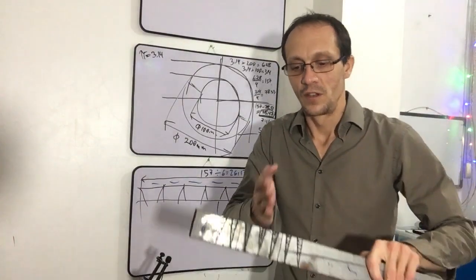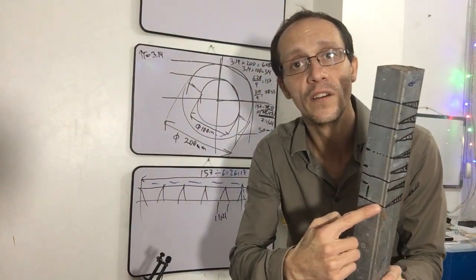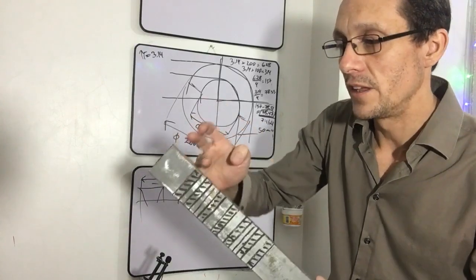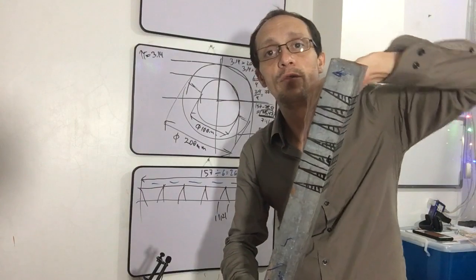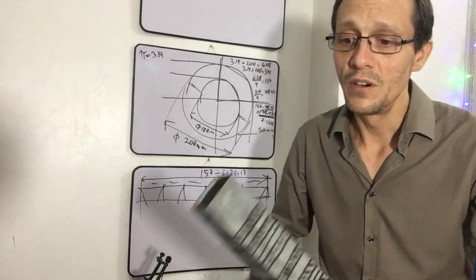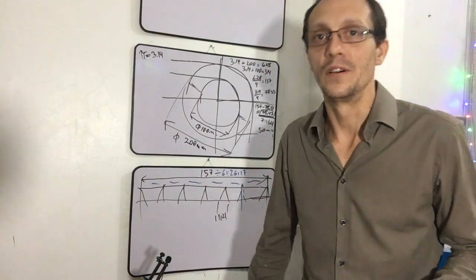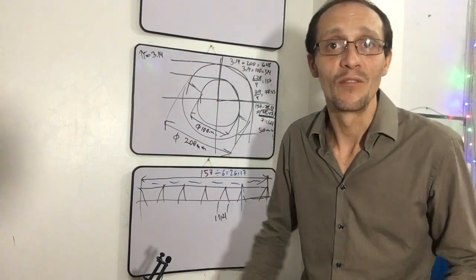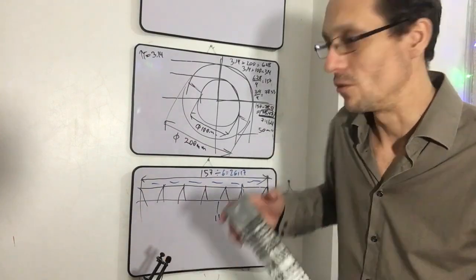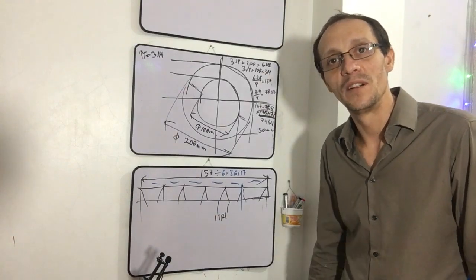Once you're finished with your calculation, you can go and cut away the triangles with your grinder or saw. Here you don't make any cut — only at the marked spots. You make the cuts here, cut out the triangles, and then when you do the bending it will be exactly 90 degrees. After that you do a little bit of welding, then fill it if needed — like body filler — or just do a good weld, then sand it and paint it with epoxy primer.